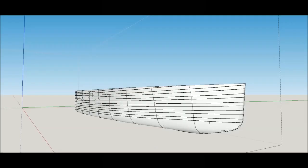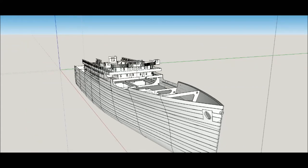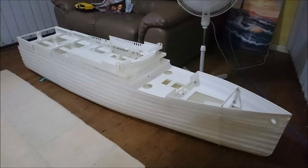The next major section was the upper section of the hull half — all the superstructure parts. I specifically designed this part to be really thin and super light, because I didn't know at the time what the buoyancy was going to be like. I know from experience that Titanic models tend to be a little too top-end heavy out of the box, so to make one that floats upright with enough buoyancy tends to be a little bit hard. So I went super thin with all of the superstructure parts. They were really hard to print, and the walls are only about one millimeter thick, but there are plenty of supports and internal structures to compensate.